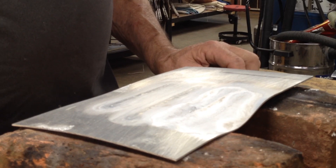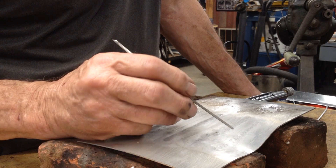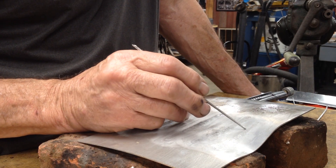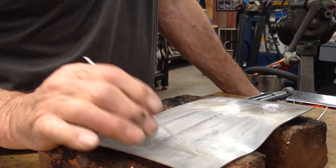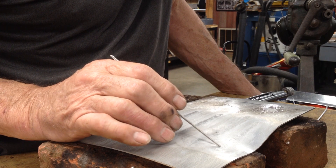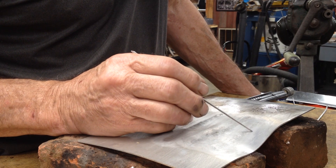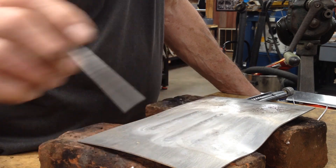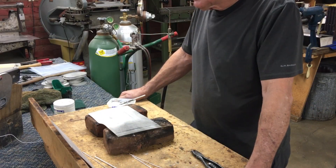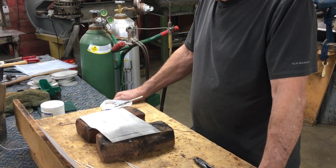I'll take that and wash it off. One thing to notice is, even though I sanded this metal a while ago with clean sandpaper, you see this discoloration floating all over — that's all on the surface of the metal, so the metal wasn't as clean as it could be to start with. More telling is the dirt that floated right over the top of the bead from the surface of the metal. So no, you haven't seen Pebble Beach caliber welding, but you've seen successful gas torch welding of magnesium — and it didn't catch fire.